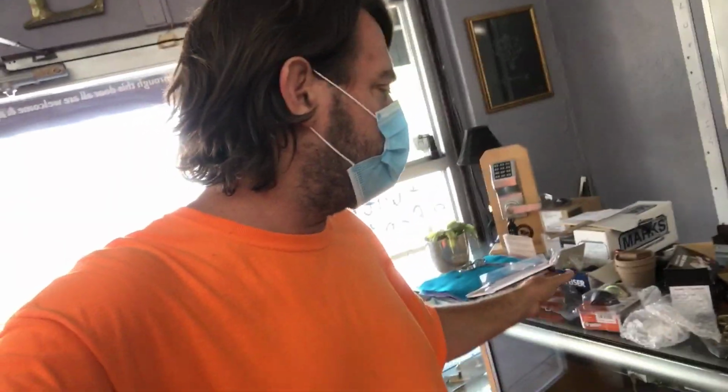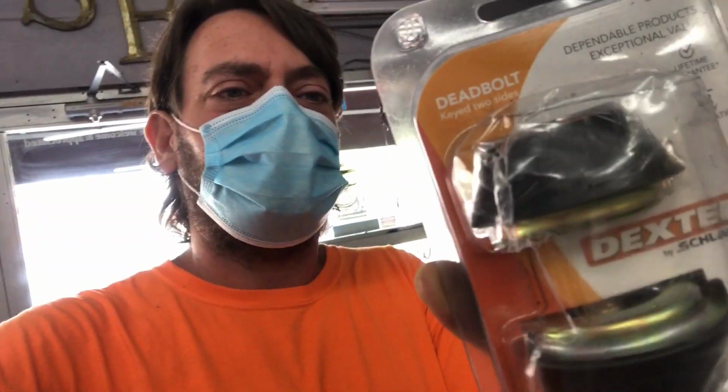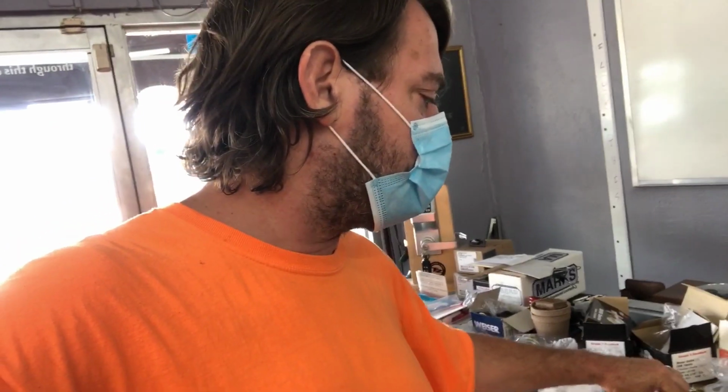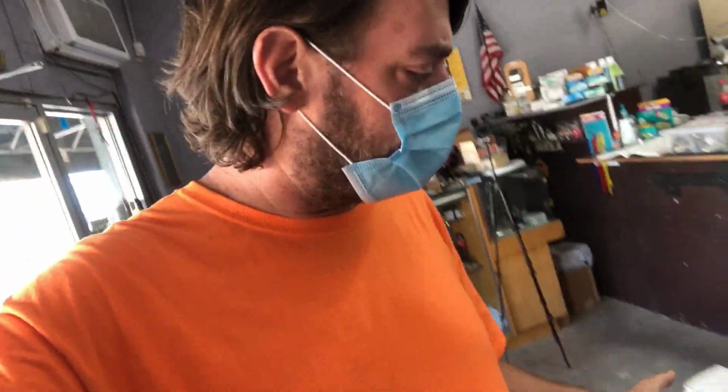The reason I don't ever buy them often is because that's one of those products where, since it's only available in Schlage Keyway, you can do the same thing with this Schlage Dexter tailpiece. The latch is that cross style. Less chance of the tailpieces breaking, because honestly, this was one of the worst things about the 160 series, was those tailpieces would break if over torqued, or if the door shifted, or whatever the case was.